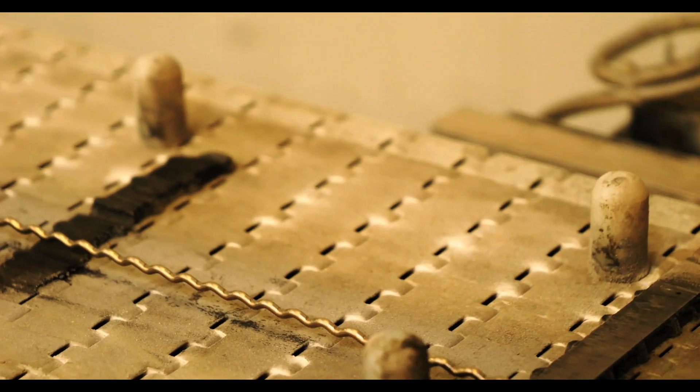They may look similar, but crimped wire mesh and woven wire mesh have several manufacturing and structural differences. Pre-crimped wire mesh requires a pre-crimping process that physically bends and alters the profile of those individual wires, creating a more stable and rigid weave where the wires are held in place better. These crimps create a textured surface, but also help maintain the shape of the mesh and the spacing of the openings, rendering the material more suitable for heavy-duty applications subject to high levels of mechanical stress. Woven wire, on the other hand, interlaces the wires at right angles without processing them before weaving. The lack of crimping often results in a smoother surface. While not as rigid, woven wire mesh is considerably more flexible and easier to form, though flexibility is also heavily influenced by wire diameter and weave pattern.